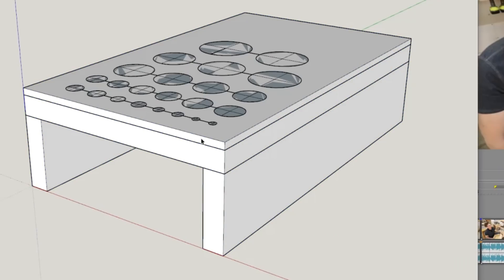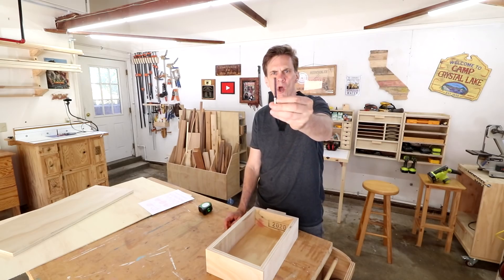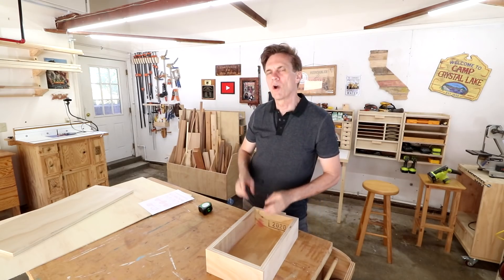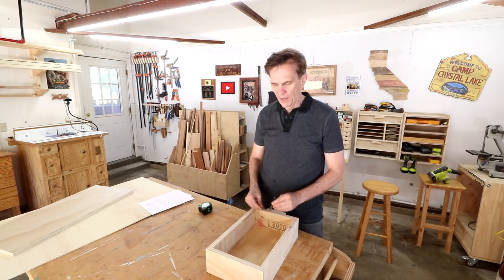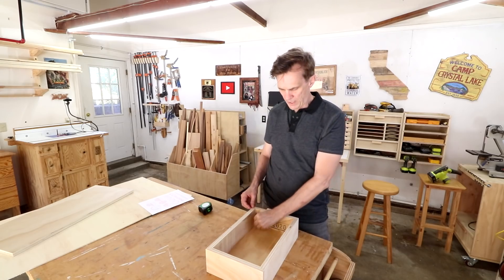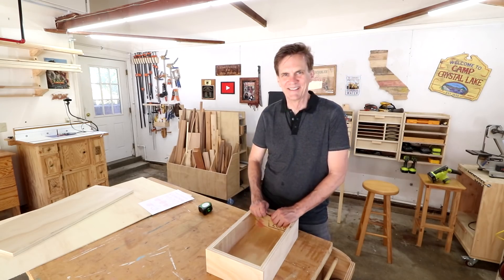This is going to be a quarter inch plywood where I'll cut the holes all the way through, and then three quarter inch plywood for the next layer with a hole going all the way through the size of the shank. Two more pieces will be supports to hold it up so the entire unit can be lifted out of the drawer. I don't really plan on lifting it out often — I'll just take the drawer wherever I need it. But I do want it removable mostly because of these quarter inch bits where the cutting head is smaller than the shank. There's always a possibility that a bit could fall in there and get underneath, and I want to be able to get under there if I have to.